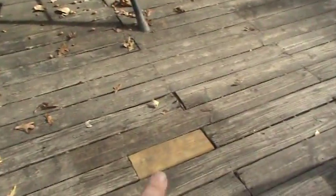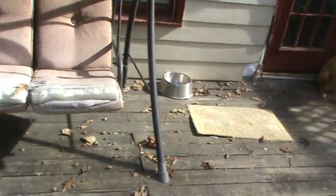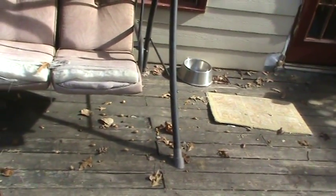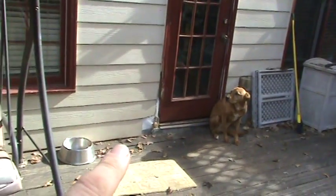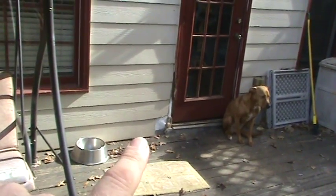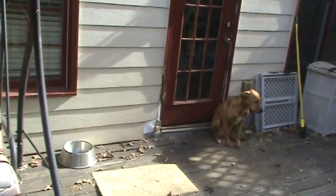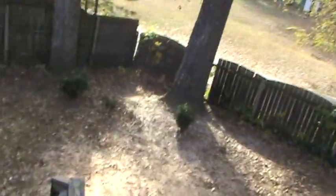The inspector noted a few places — this is an improper patch right here. You can see where the deck boards have warped from water. This deck was nailed; we would screw it down. We have a doggy visitor today! We've got about four pieces of deck here that need to be patched in — we'll patch in six-foot sections. The door where the dog is right now, we've got some siding on the left side that needs to be patched in, a little bit on the right side, and then the door frame, threshold, and threshold support at that area need to be done.